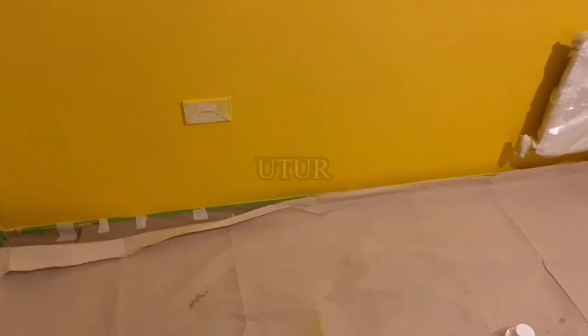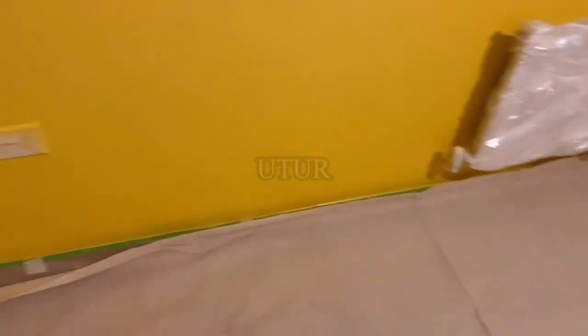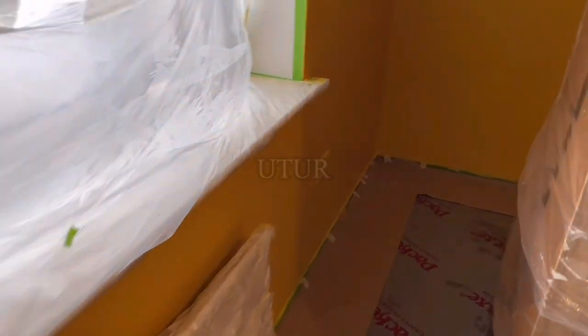Once we're done painting, the next step is to visually inspect all awkward angles and areas painted outside of the awkward angles — look for any spotting, any unpainted areas, and paint over them. Typically after the first coat I have waited about four to six hours before applying the second coat — one base coat and two overcoats, spread at intervals. When you run the first coat it doesn't necessarily look brilliant, but subsequently when you overcoat the base coat it comes out brilliantly.